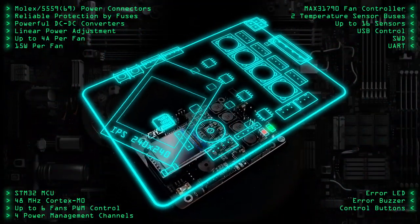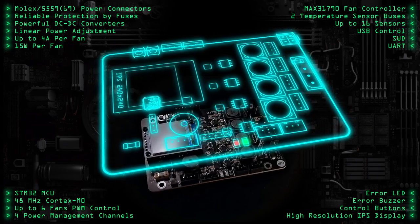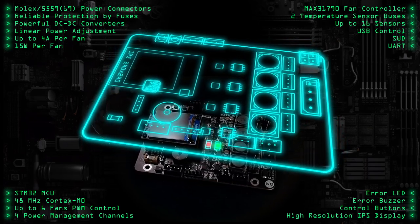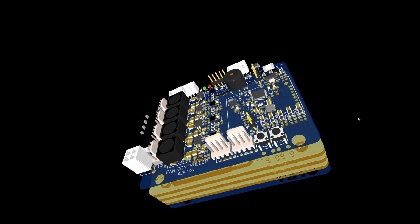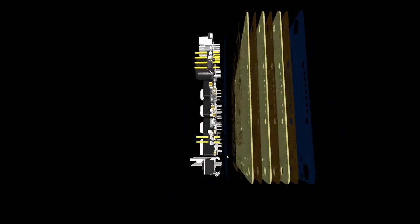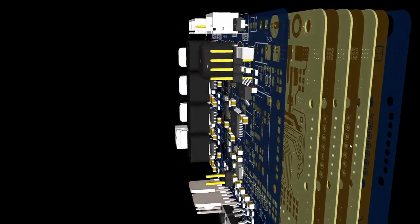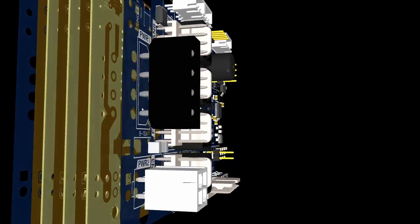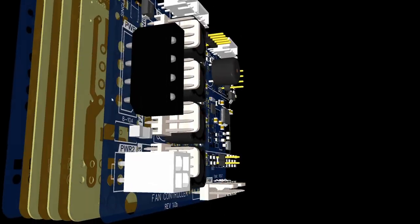There's also a 240×240 display module, which can be optional. A budget version of the same board is possible — without the display, with a simpler MCU, less beefy inductors, and skipping some DC-DC regulation blocks, replacing them with jumpers to the 12V bus. The PCB is 4-layer, with two internal layers as solid ground planes — good for minimizing current loops and ensuring return paths for digital signals aren't interrupted. I decided not to split the ground; it's common to both power and digital sections, but power and digital components are physically separated as much as possible on the board.